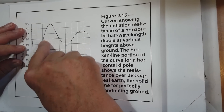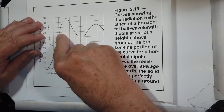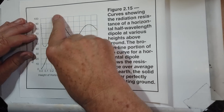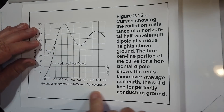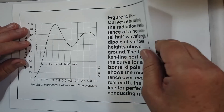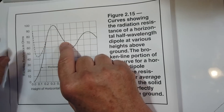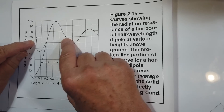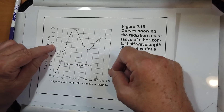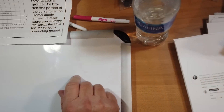You're going to come up to around 70 ohms and have trouble finding anything in between. So height above ground makes a difference in the impedance of what you're looking at. Half-wave impedance gives 70 ohms, but this would then be full-wave impedance for something else — notice it's settling out around 70.